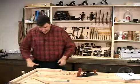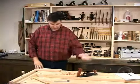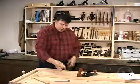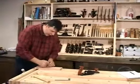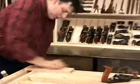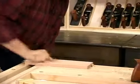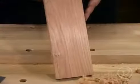Another great tip is you always get a little bit of streaking on the wood from using a hand plane, regardless of how well you sharpen it. The easiest way to take care of that is to just use the shavings that you generated from the hand planing, ball them up, and burnish the surface of the wood with them. This will remove the streaking — they have just enough tooth to polish the wood, and you're going to get an even glossier surface than just off the plane alone.